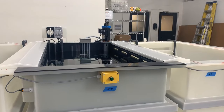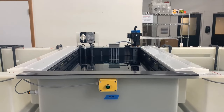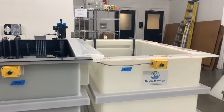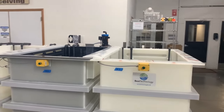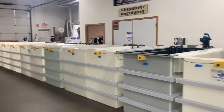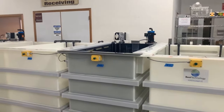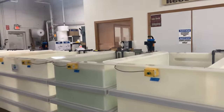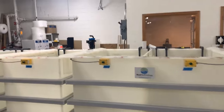Because type 1 is treated with heavy metals, we follow that up with an RODI rinse tank at ambient temperature, which separates out this waste stream from others because of the heavy metals. The 12-tank optional system can handle type 1, type 2, as well as passivation and cleaning, all in one line, ensuring drag-out is minimized between process steps.